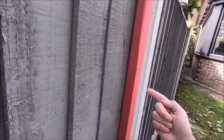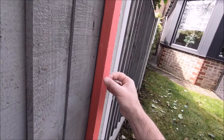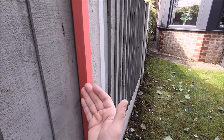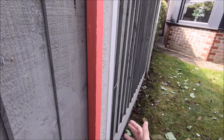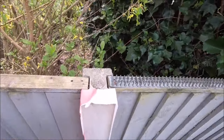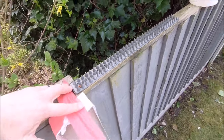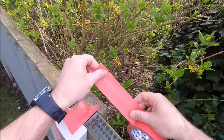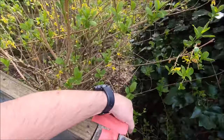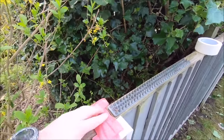You don't have to wrap it round — you can just leave it like that. In fact, by not wrapping round it will be more helpful against flicks from the paintbrush getting where you don't want them. That's a bit of extra protection. Generally I'd just stick a piece on the top there as well to stop flicks getting on the top — that top needs to be protected.